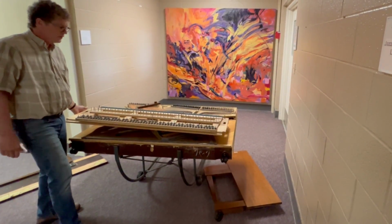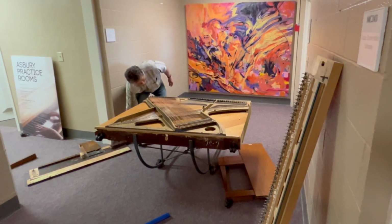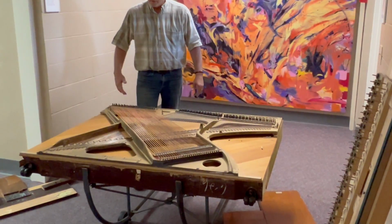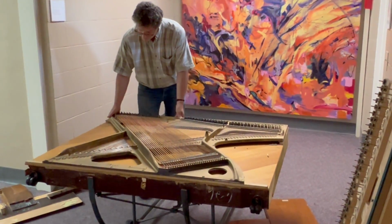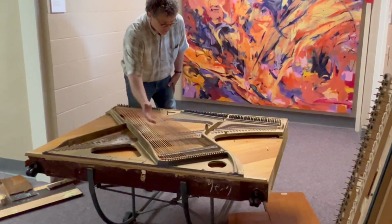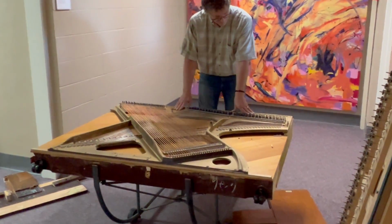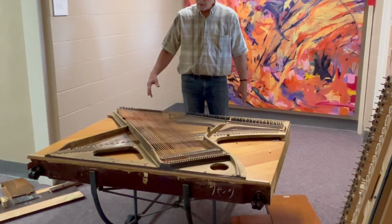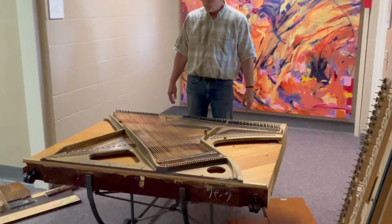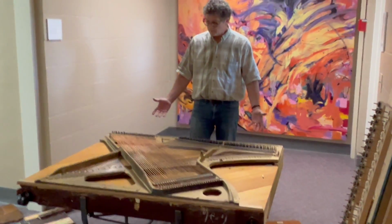With the sides of the piano removed, now we have the key bed, which can be taken out. Now what we're left with is called the strung back. This is what you'll see in a factory. You'll see stacks of these, or they'll be leaning up against, they'll be in a rack. And so the strung back consists of the back frame on top of which the soundboard is glued, and the bridges are glued to the soundboard, and then the plate is bolted down to the soundboard and back structure, and of course the pin blocks under here. And then the stringing is done when the piano is in this state. So the stringers will string the piano, and they'll have this, what's called a strung back, as it goes down to get everything that we've already taken off added onto it. But this is what this part will look like.